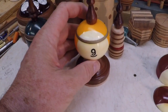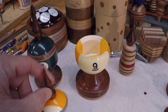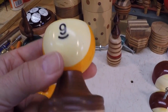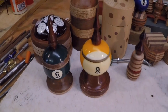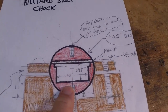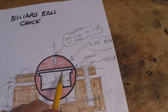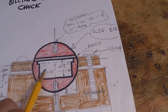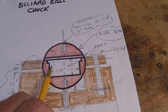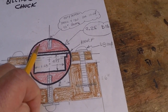This is another one I made — pretty similar, and I improved the technique. The process of getting these things hollowed out was interesting to figure out. This is what the ball looks like in cross-section: it's spherical, there's a cut line for the top where the lid comes off, and then once the top is off I use Forstner bits to make a cylindrical cavity for the box. There's a little rim that I put on here so I have a register point for the lid.